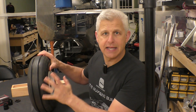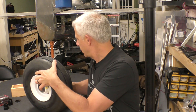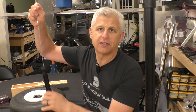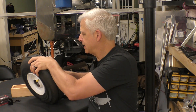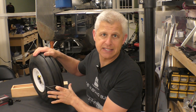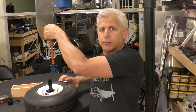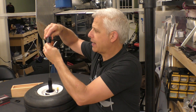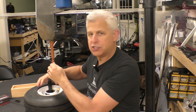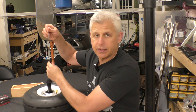I'm going to start with the stem up and feed the cable through. The first thing I need to do is put the spacer on that fits this particular tire. These spacers from McFarlane fit just about any type of wheel you're likely to work on, and they even have an expansion set for more unique aircraft wheels. I've slid this in, brought it down, and now I take the second spacer to center everything. It's a really perfect machine fit — these parts are very well manufactured.